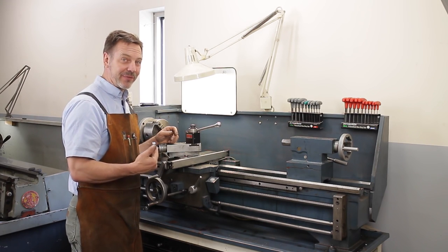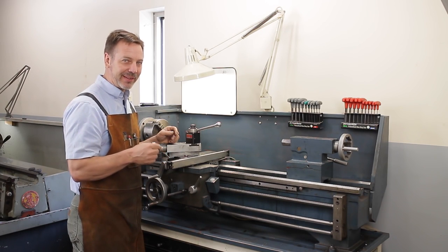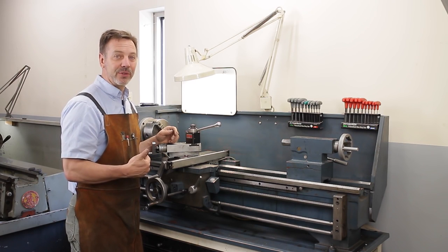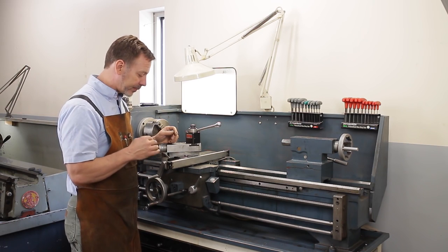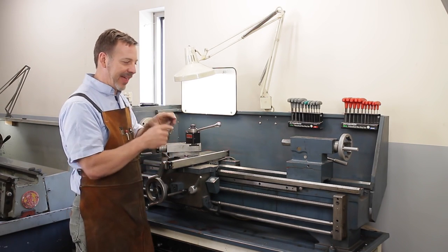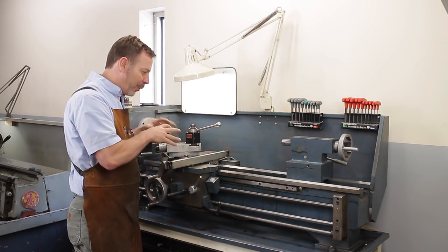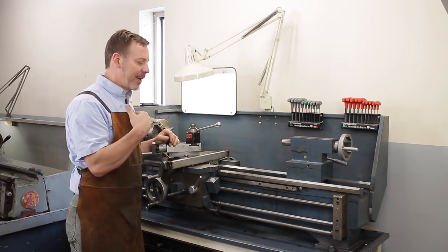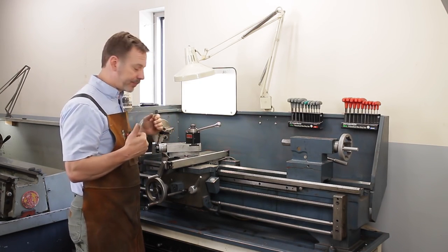If it's a broken gear, if I'm hearing a click, click, click that's very consistent, that's usually damage in a gear. That's $350 worth of work to me, and I don't even know if I'll be able to get the gear once I get in there. Also, if it's a broken gear, sometimes you'll engage it and that gear will just be in that spot where it's missing the tooth and it won't turn and it won't do anything. You'll get very frustrated. So make sure you check that. Make sure you listen very closely for the whole thing.